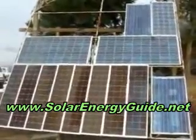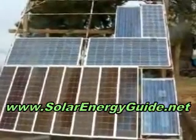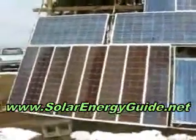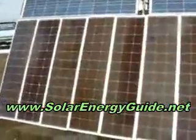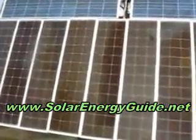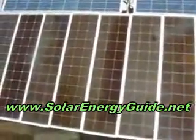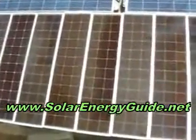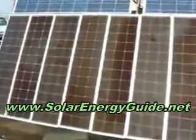I'm just going to take a look at our solar array, which of course is a work in progress. It's a 10 by 10 metal frame and what we have here are some used panels that I purchased. They're probably 25 years old from Arizona, but I purchased them based on the current that they put out. They're about five and a half volts each, so I had to wire them up to charge up our 12 volt system. Takes up a lot of space, but it does generate some energy.